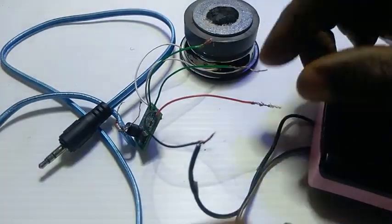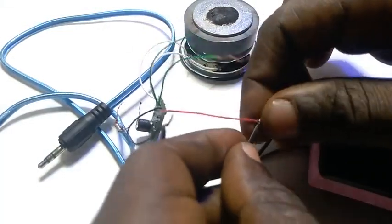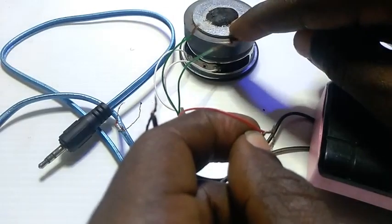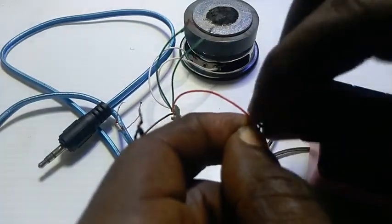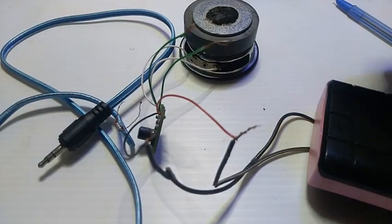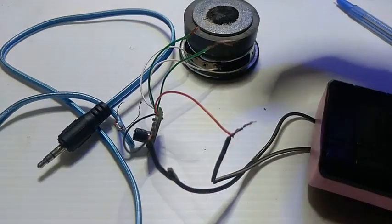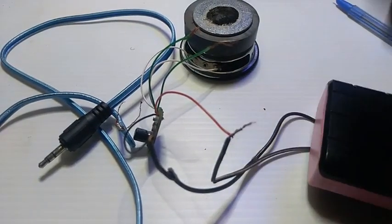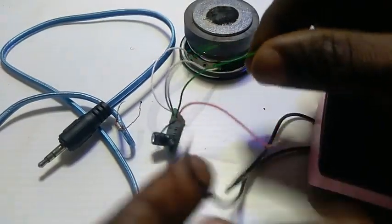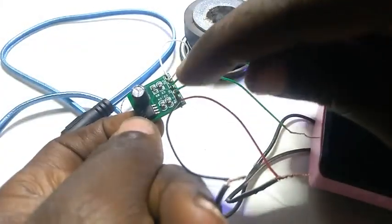Follow me please. Then this is the positive pole, and you connect it together with the positive pole of my battery. Mind you, this board is just 5 volts, so don't use 12 volts or 24 volts on it. That means your power bank, your laptop, or anything else at 5 volts will definitely power it, and a 3.7 volt cell battery will carry it also. So my positive and negative poles are connected. Now let's move to the next thing, which is our input. As you can see, we have the input there.